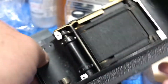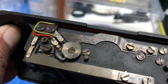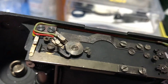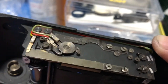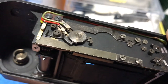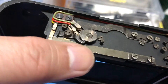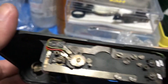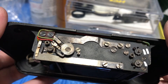Let's cock the shutter and charge it. Take a look at this — see what happens when you cock the shutter. See how the escapement locks the start cam? Now let's activate the shutter — this will release the start cam.